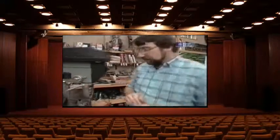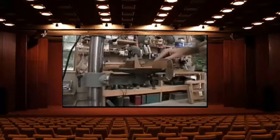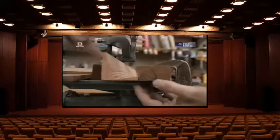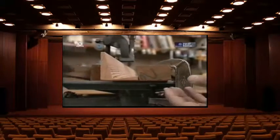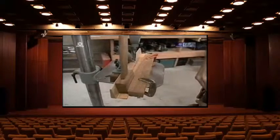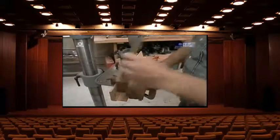but it means a little bit more work. Now what I have to do is figure out a way to drill the mortises at a 12.5 degree angle, which is the same as the angle we used on the armrest. So I've cut some wedges. One that sits in the bottom, that's 12.5 degrees, another one in the back, another one in the front. And what happens is the piece sits in like this, the mortise machine works straight down, yet it's setting the mortise at a 12.5 degree angle. And I'll do it the same way I did the top rail.